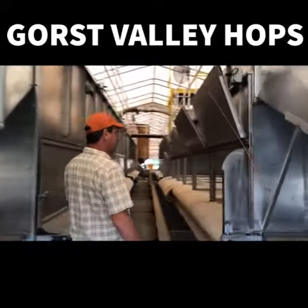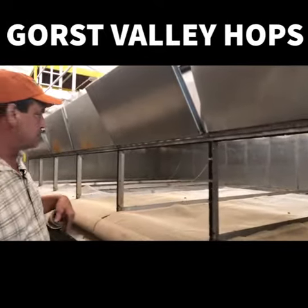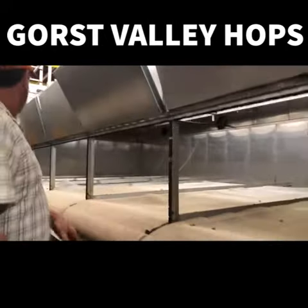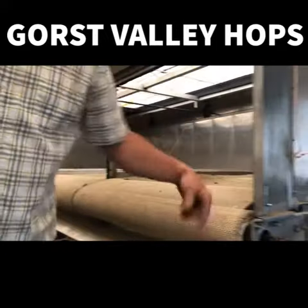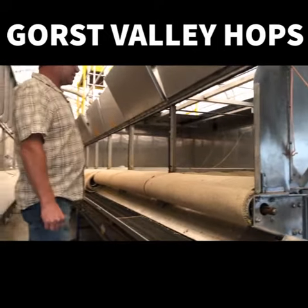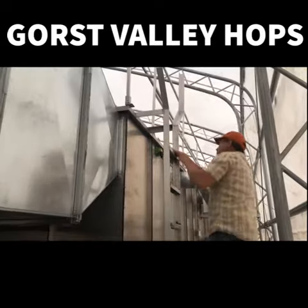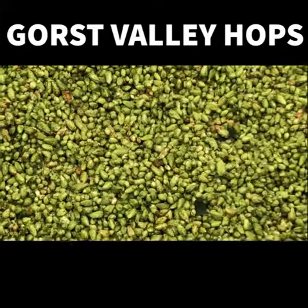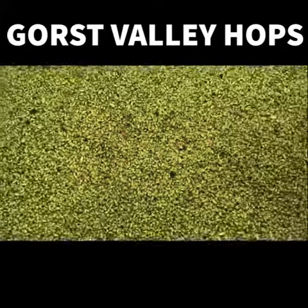It gives you a good idea how it works. We've got this industrial netting in here, so we pull in and crank out the load with a load handler. Literally put a wrench on it and turn it out, and when we're emptying it, it goes on to this belt and heads down to our conditioning tank for bailing. About 5,000 to 5,500 pounds of wet hops inside of this 12 by 24 oast — that represents a day's pick.